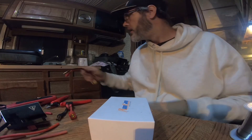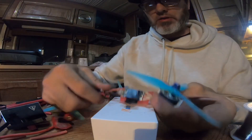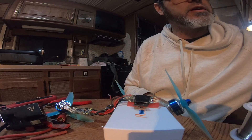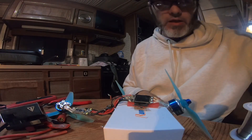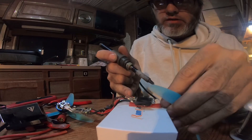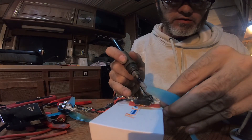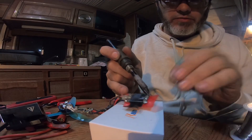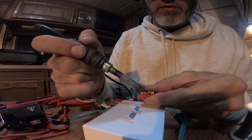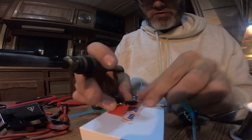Now I don't need to do this, but we'll go ahead and solder some small stuff. This here is a Kamikaze 66-amp ESC. I'm going to turn my soldering iron back down to 799. Same deal — clean it off on your metal sponge, get it a little wet, then just touch it to clean up your solder pad. Make sure this is nice and clean — a fresh, good surface.